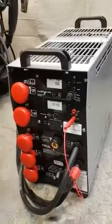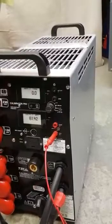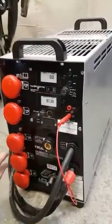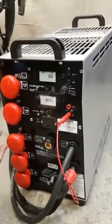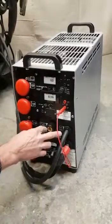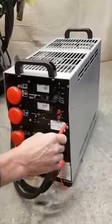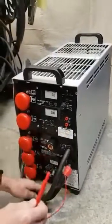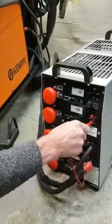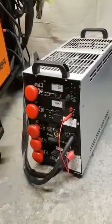With the Calibrator Pro, there are a couple of 4mm sockets — you can plug in a multimeter such as a Fluke. You can also run the Calibrator in series with the welding circuit, so instead of using the internal loads, you can actually run it in series with an actual welding condition. If the operator wants to run a weld and wants the precise parameters, you can actually measure it directly. This little lead here is the positive volts pickup lead. If you need to extend the cable to reach further beyond the length of these cables, it's better to bring in extra volts pickup lead and plug it in there — that removes any volts drop in the cable so you get a much more accurate reading on your volts display.